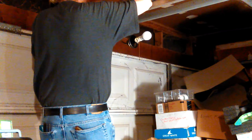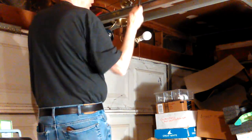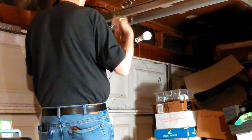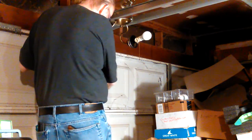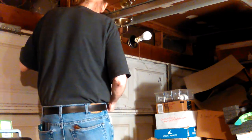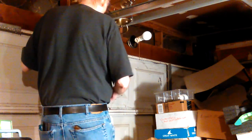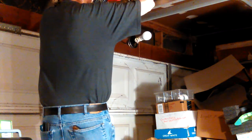Okay, from that white wire, which I always forget, well, it depends if it's wired right, too, but from the white wire to the garage door thing, I get 64 volts AC. Now, that's what was getting me, because my arms were touching this, and that thing is mounted to the 2x4s, to all those studs in there, about 6 or 7 2x4s across there. So to the ground wire, it's not what I was thinking, like being wired wrong necessarily.